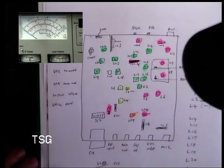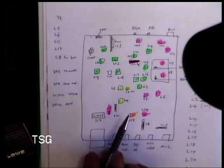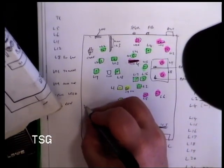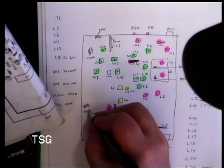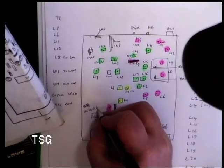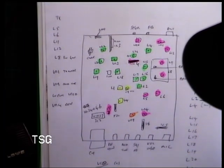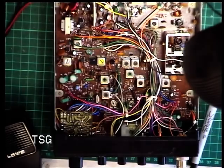So, all this setting up the Delta tune. What I said at the beginning, apart from setting up CT2 for the usual channel 20, 27, 79, 125, was a load of bunkum from me, and you set it on these radios for, and I'm going to write this in, 10.24046 at test point one. I'll have uploaded these service manuals to Scribd so that they are available for free use. So that's a bit of a faff, and that's so that we get the Delta tune working.